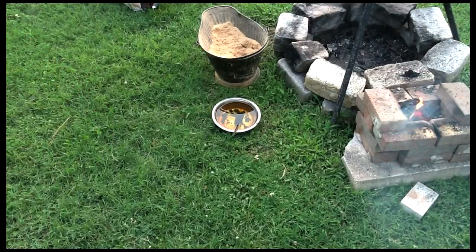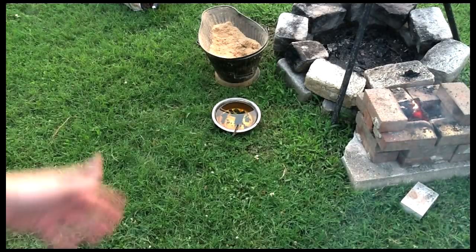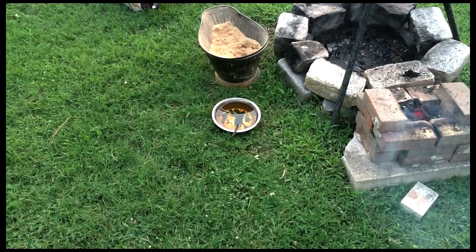All right, next step is to temper it. I'm going to stick it in the oven at about 450 degrees for an hour. I'm not going to bother showing that. That's pretty straightforward. I will have the oven empty, though. Don't worry. And I will clean this off a little bit before I put it in. Be back.